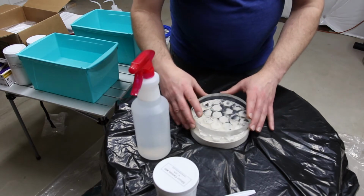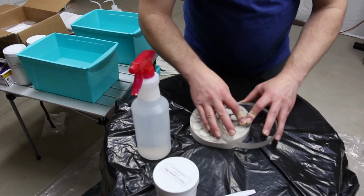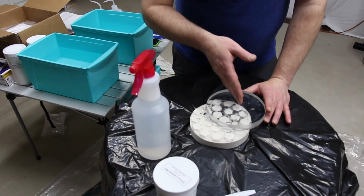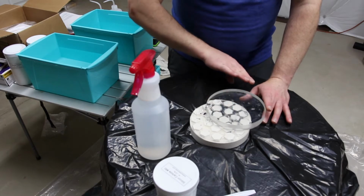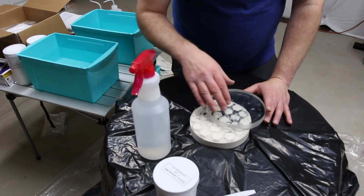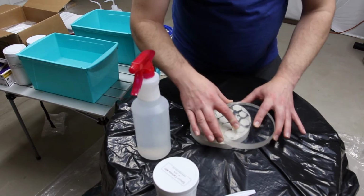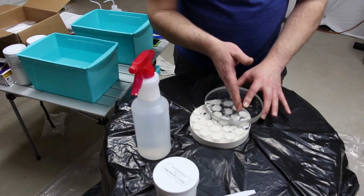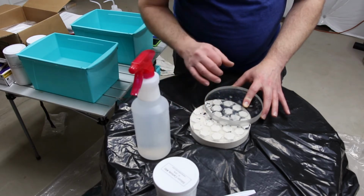You don't want to wander into the middle, because by applying pressure in the middle, that's going to apply pressure more along this bottom edge underneath here, which is going to carve out the center. That's going to make this glass blank become concave underneath here. And so that's what we're trying to do. We're going to try and put pressure down on the center so that as I'm doing a chordal stroke, it's going to help grind out the center section of the mirror and make it concave underneath. The tool will become convex.